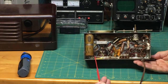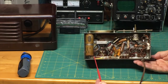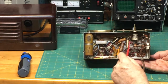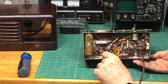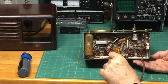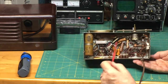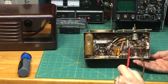Now with the newer hobby maker movement, certain values of passive components are easier to find than others. These components are more RF and audio. They're a little bit more difficult to find. So we have to replace every single one of these, and then we can also test the resistors. Here's a resistor, and test those for their values. Now these resistors can be tested, and if they're good, we can keep them in place. Likely they're good. Resistors don't degrade significantly, not nearly as much as these capacitors would over time, so they're probably okay. But we'll test them anyway.